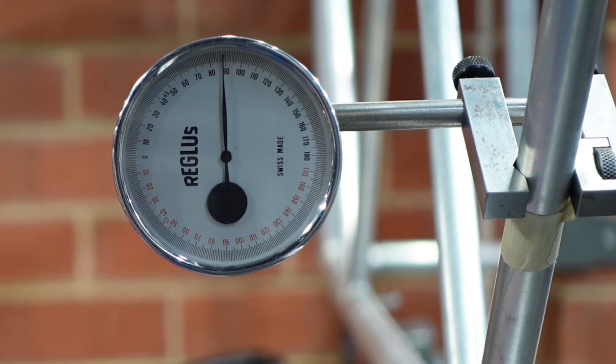That looks like it's around about two degrees to my eyes, so it's stiffened up a little bit more. The resonant frequency started around about 100 hertz - putting the top member on took it up to around 200, and putting the bottom member on then took it up to around 230-240. Quite a reasonable increase in stiffness. It still shakes a little bit more than I'd like, so I need to have another think about that. I may also have to look at the hinge as it's a little bit sloppy and tending to make it droop. But this video - I'd claim this as a success. Thanks for watching, see you for the next one.